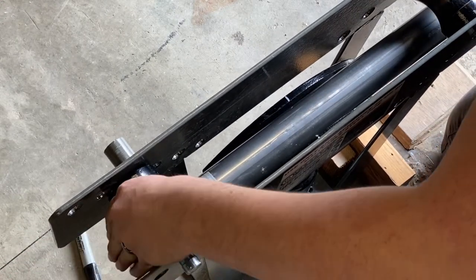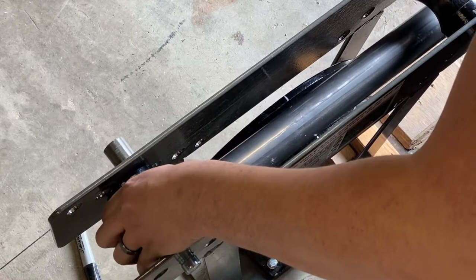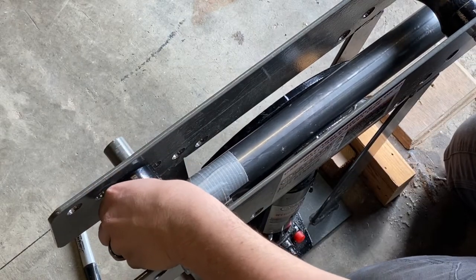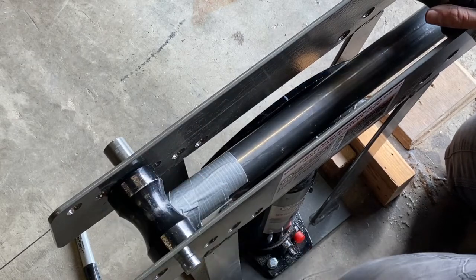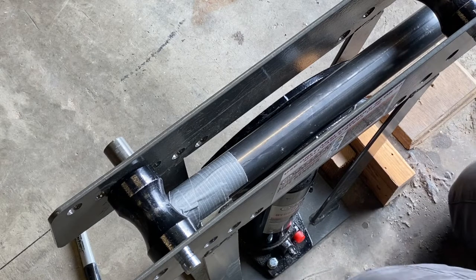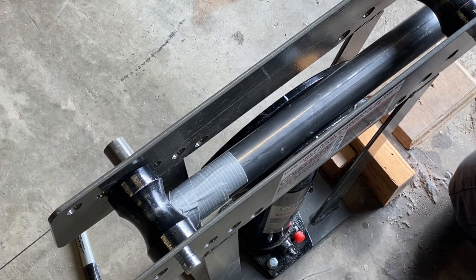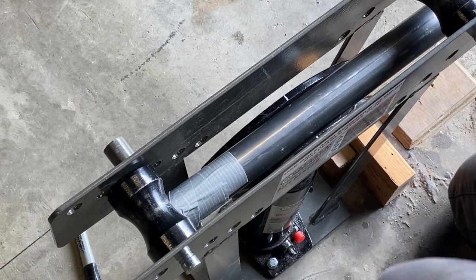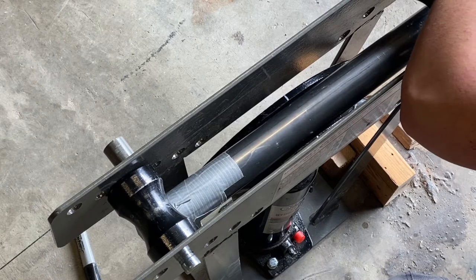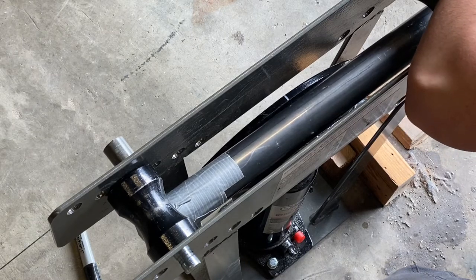One of the first things I'm going to do is take a piece of tubing and run it all the way out. I've got this basically right on the edge of the roller, which in my experience works okay. It doesn't slip off or anything. I am going to orient this, it's HREW, hot rolled electric welded. I'm going to make sure the seam is at 90 degrees to the surface that I'm working at. So right about there.